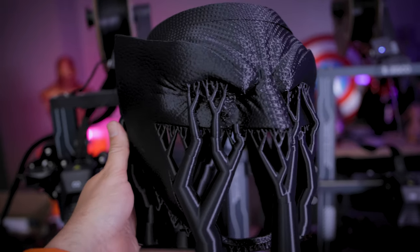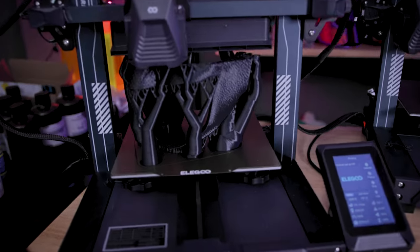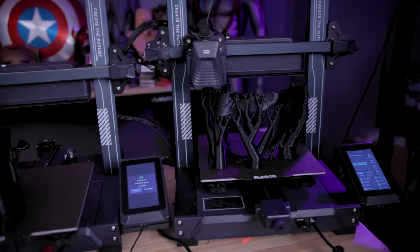This gives me a good opportunity to see if the mask will fit properly, and it is a nice snug fit — looking really clean other than that seam break there up top. When it comes to a layer shift in your print, you could try to repair it by separating the two parts, continuing the print, or reprinting the top part and then joining the files together. However, I don't want to monkey around with that, especially since it has really nice texture detail that would be hard to sand and smooth out properly. So I just reprinted everything over again — not once, but a second time as well, with two different variations of the same print.